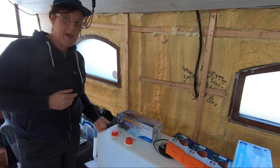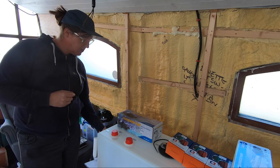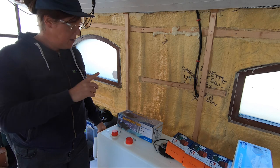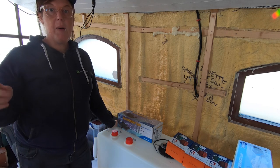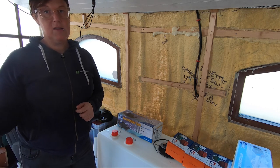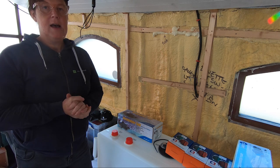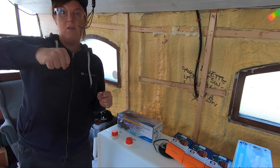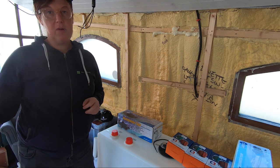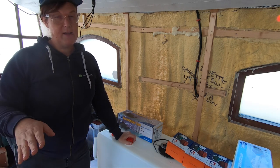It also has three extra inlets — so there's the toilet inlet, and then three other inlets, four in total. The three other inlets are for the three pumps that are going to be around the boat: the bathroom sink, the galley sink, and the bath or shower. I will be able to divert them using a Y-valve either over the side or into the tank. When I want to empty the sink I have to have electricity to do it — it's not a gravity fed system anymore, but that's a trade-off I'm happy to accept.